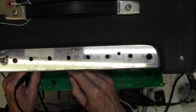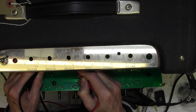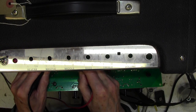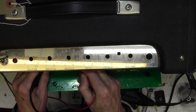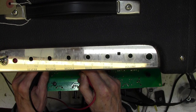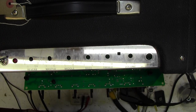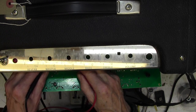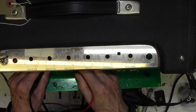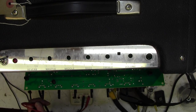So there's a beep, there's the fuse holder. Oh, right, okay, so we do have continuity. All right, well, come on. Do we have continuity between this spade connector and the outgoing green? Yes. Do we have continuity between this spade connector and the other outgoing green? Yes! That's very strange. That can't be right, because we measured no voltage on the outgoing greens here. We measured a voltage on the incoming greens. What's going on now?